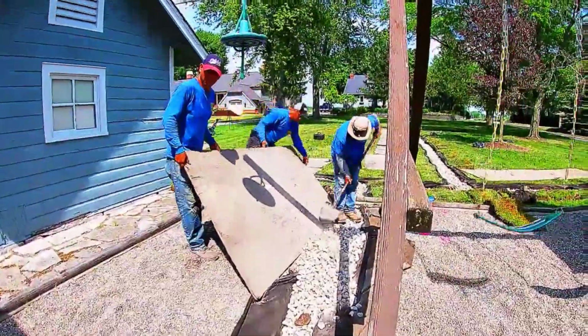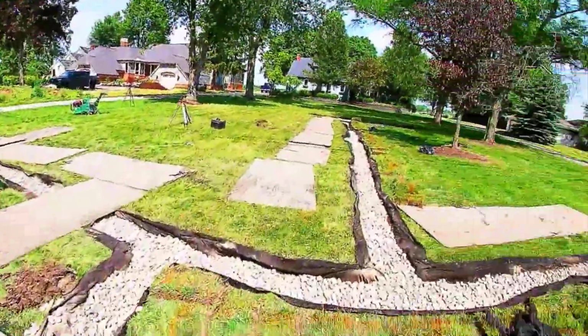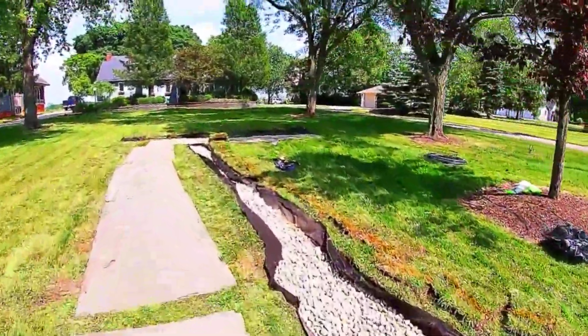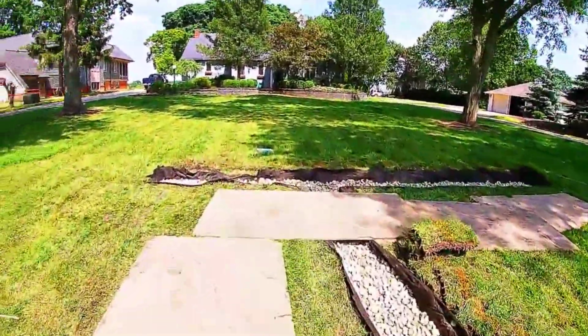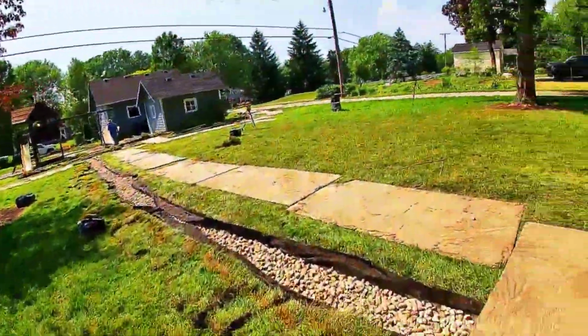So you can see we got the big 1.5 inch, I love that, big 1.5 inch round rock. Everyone says, well, can I use crushed limestone? Sure, just make sure it's 1.5 inch. Now, crushed stone is going to have smaller voids than round rock. Round rock's going to have larger voids. It's going to move more water. Now, think about this. This is really important, people. Think about this. So these giant voids, what are they doing when they're not moving water?